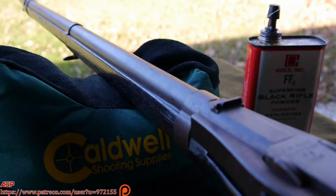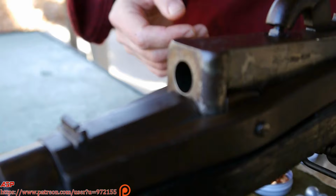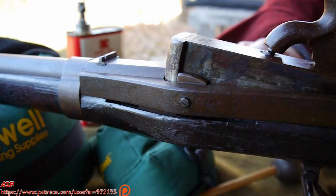It would be impossible to put a patch and ball in the breech because of the gap, it would hang up the patch. I've never seen it. There's a lot of interesting design besides the obvious breech loading advantage. You didn't mate the action directly to the stock. There's a gap in case there's a blowout with obstructions. It'll let gas blow out the sides without shattering the stock.